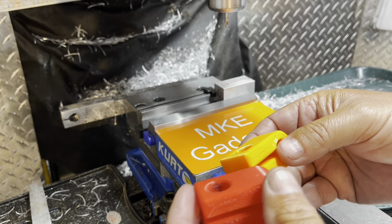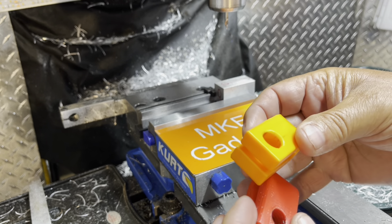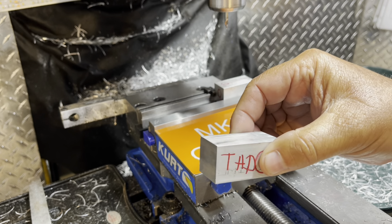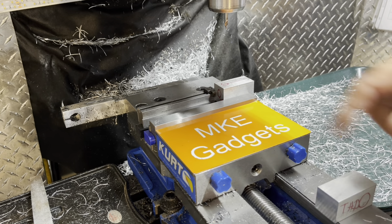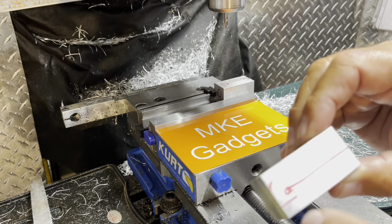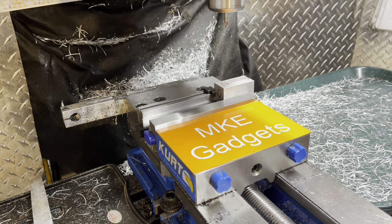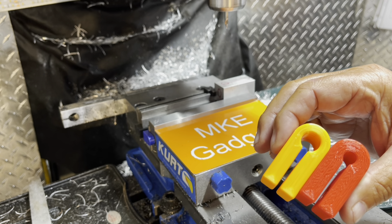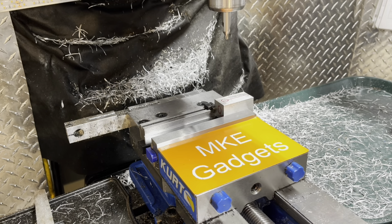So we're down to the last two parts. These two are 3D printed — they're exactly the same except the colors are different. These two holes are different in size: this one is threaded and this one has through holes. I have my stock which is two inches long, one inch by one inch. All the holes that get drilled are a half inch off each edge. I've got this set up so I can drill all the holes and just keep rotating the part. The holes are going to be drilled and reamed so you have a nice smooth finish inside the hole and the bar will slide in there silky smooth. We're going to center drill, drill, and ream — let's make some chips.